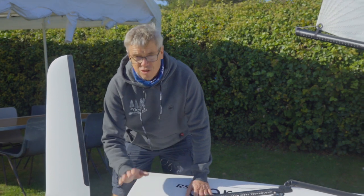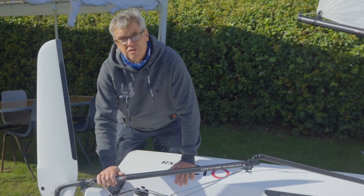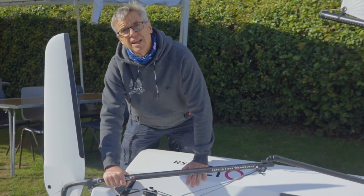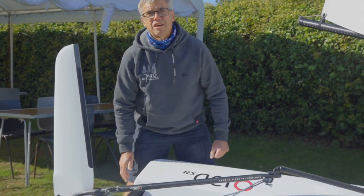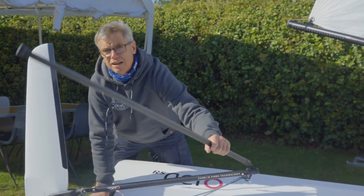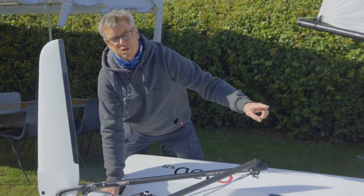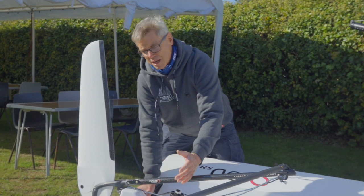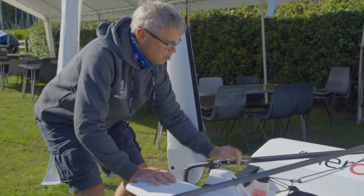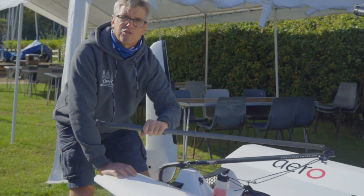Something very important to look after on your RS Aero is your tiller — you need it to get home. The tiller has gone through some evolutions over the last few years and it's on about modification four now. It's really strong; there's no excuse for breaking it in normal sailing — it'll only break in abnormal sailing and misuse. Four ways to avoid breaking your RS tiller: don't hang on to the tiller extension when you fall overboard — train yourself to hang on to the mainsheet but let go of the tiller extension if you miss the toe straps and fall overboard. Try not to stand upright in your RS Aero too often, because if you get a little acceleration and fall over onto your tiller it could break that way. And after a capsize, when you climb back in, don't use your tiller for climbing back into the boat. The tiller is fantastic for steering — don't use it for anything apart from steering and you'll be just fine.